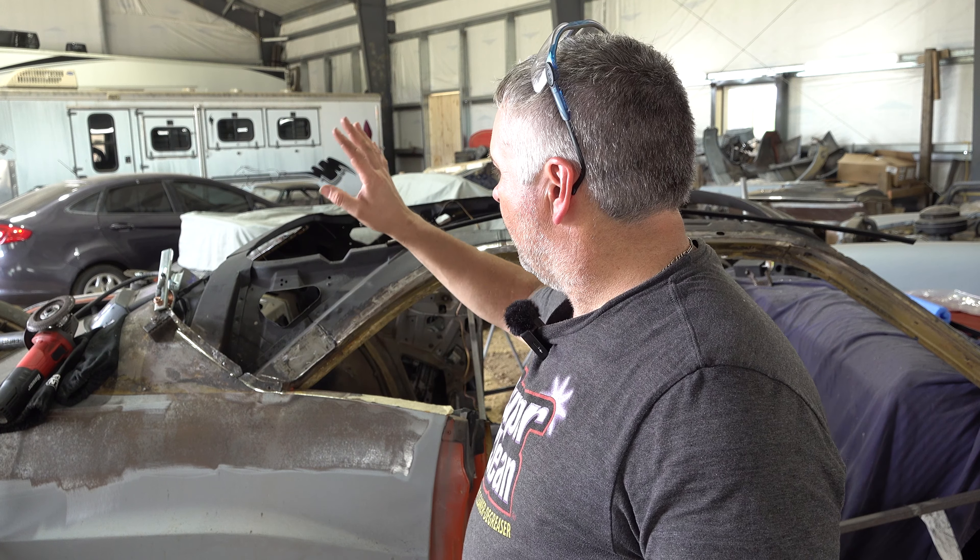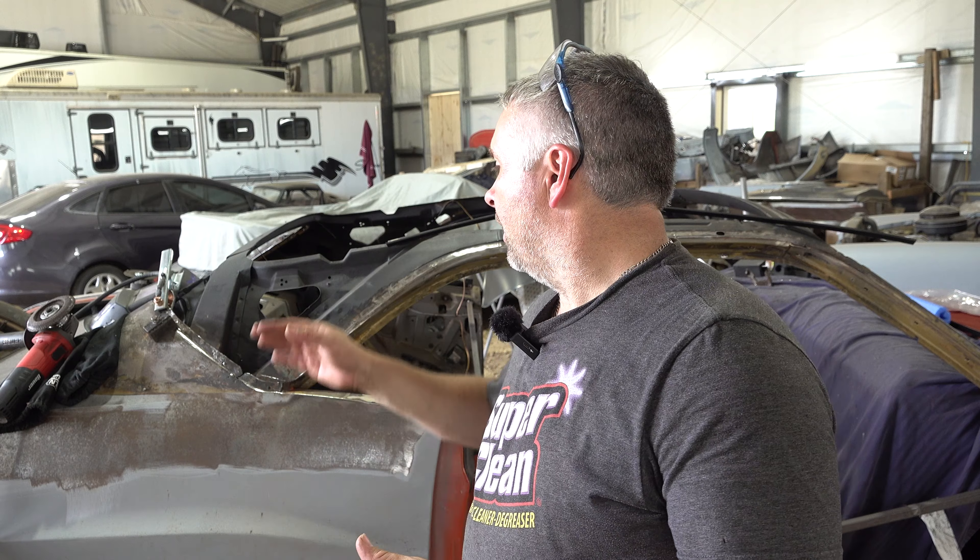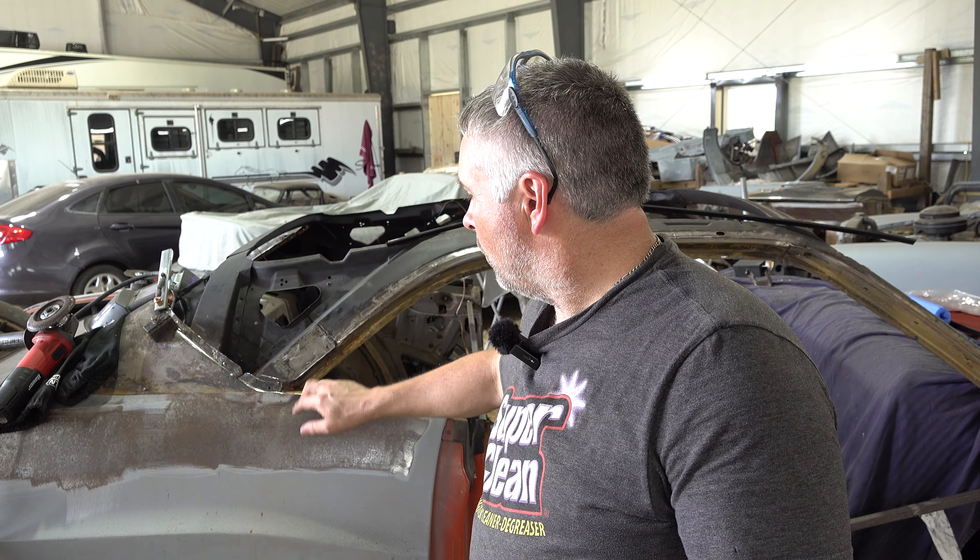We are back and I have not gotten as far as I wanted to. Spent a number of hours working my way around the roof line here, getting all the old metal off, getting all those edges hammered flat again to accept the new roof and drip rails. It's just been hot and disgusting — I haven't wanted to work in the garage when it's 84 degrees and equal humidity. But what I have done is gotten this area here that was rusted out — I cut that out, patched it in, and there's another section on the driver's side about this long, but I'm out of metal so I've got to go to the metal store.